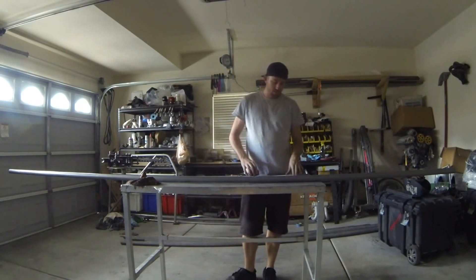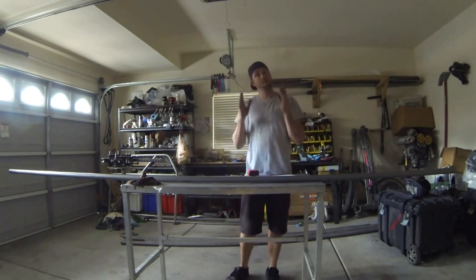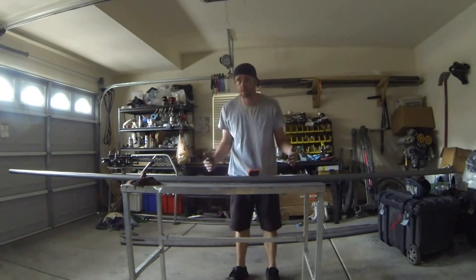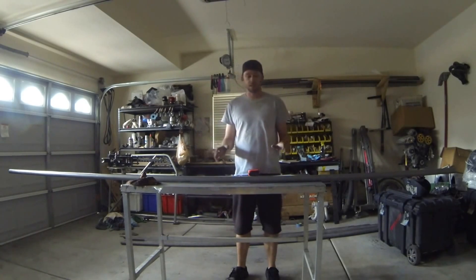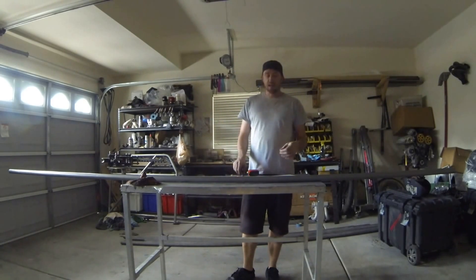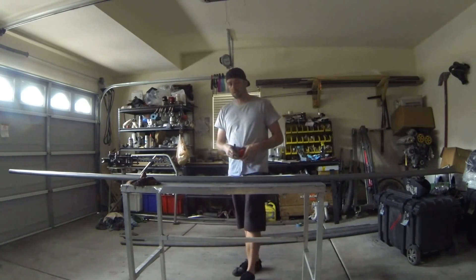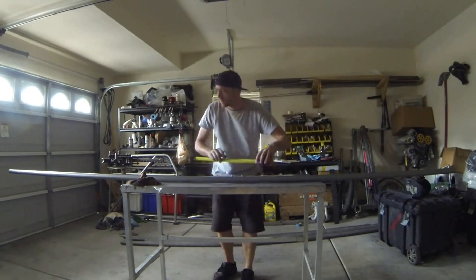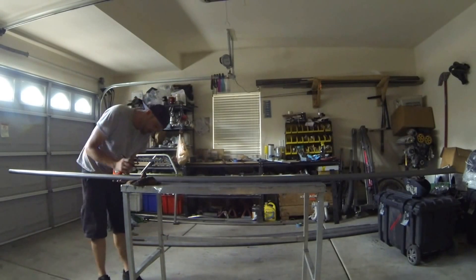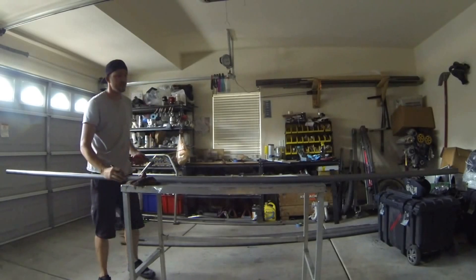According to our form, from the center line to the beginning of the first bend it's 14 inches — that's the exact measurement. If we were to bend it right now as is, it's going to be smacking the side of the car. We need to subtract our tolerance: a half inch on each side. So we're going to go from that center line — which we measured at 14 inches — subtract our tolerance, and go to 13 and a half inches. That's the start of the first bend. We'll go 13 and a half again for the second bend.